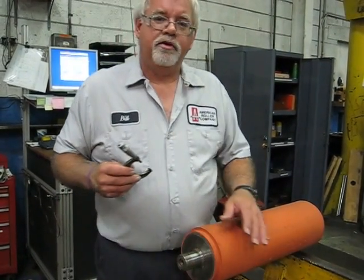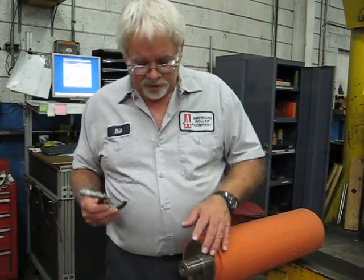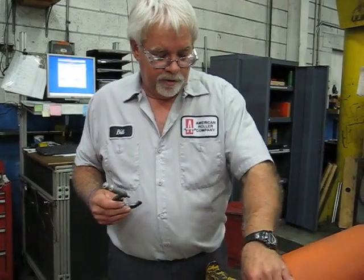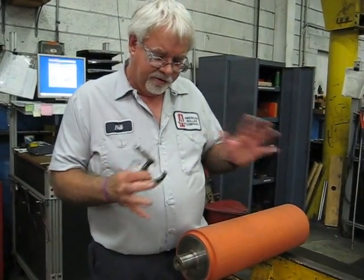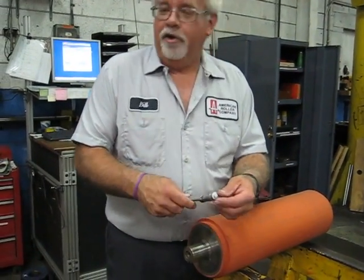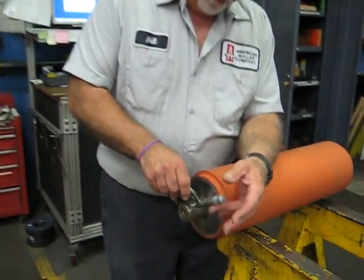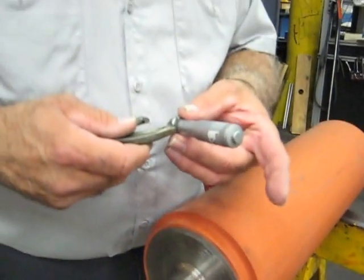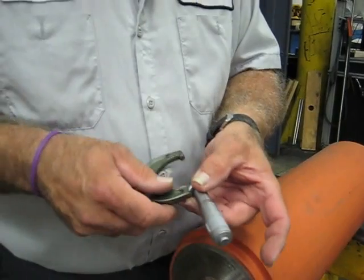The journals are a specific size for the bearing or a gear. In this case I have a gear fit on this side — I have a keyway — and so it's designed for a certain size and a certain fit. We'll measure that up. On this one we're at 1748, which is a slip fit for this gear surface, and it's exactly what the customer wants. So we're perfect on this one.